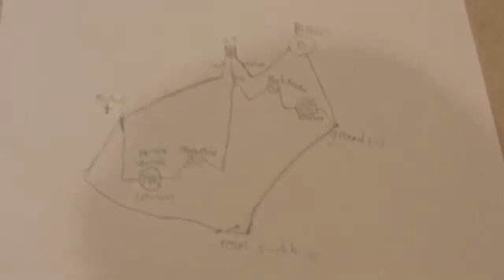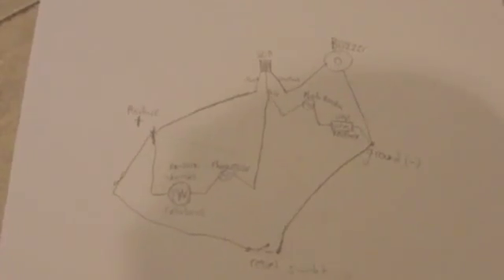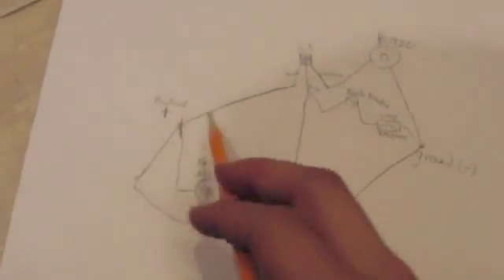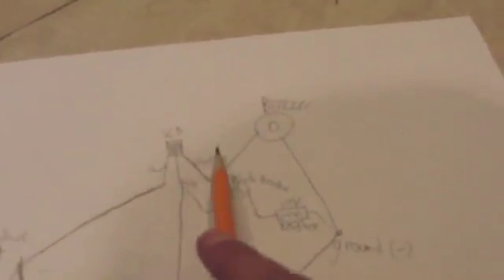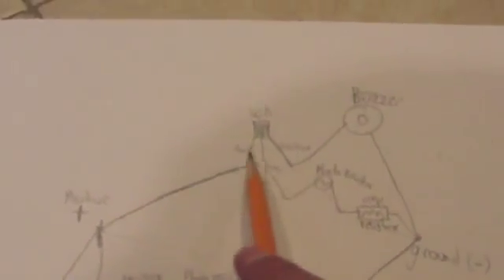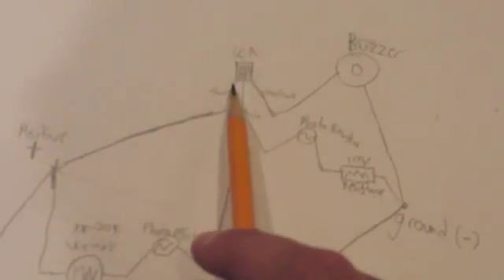In order for you to troubleshoot, you need to actually understand a little bit about how the circuit works. This is my schematic that I tried to make more understandable. So basically, you have your positive here and ground. The SCR is the main component — it has the anode, the cathode, and the gate. I might have gotten the anode and cathode mixed up — leave a comment if I'm wrong. The SCR is basically a switch that, when it is triggered, it stays on.